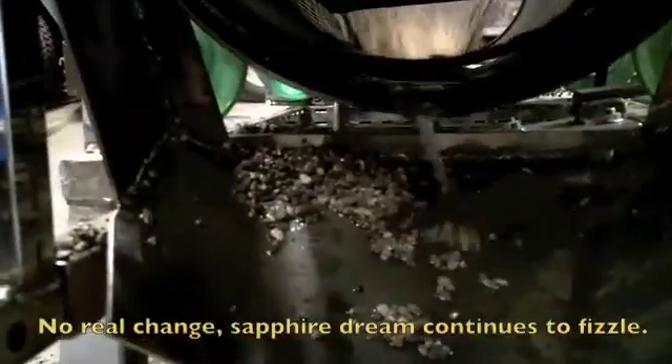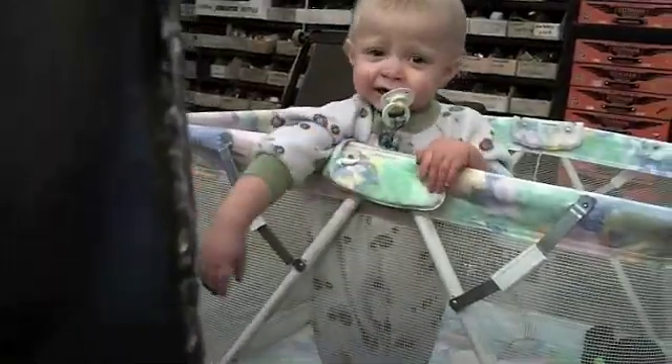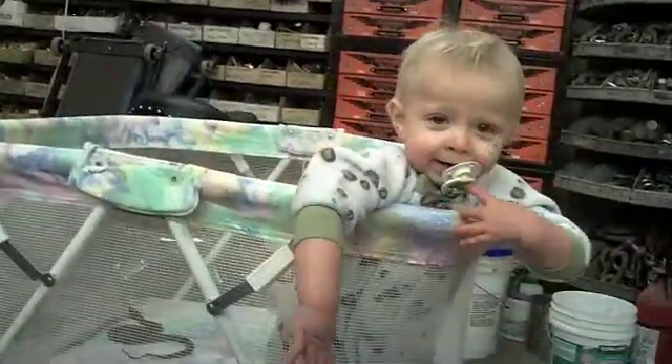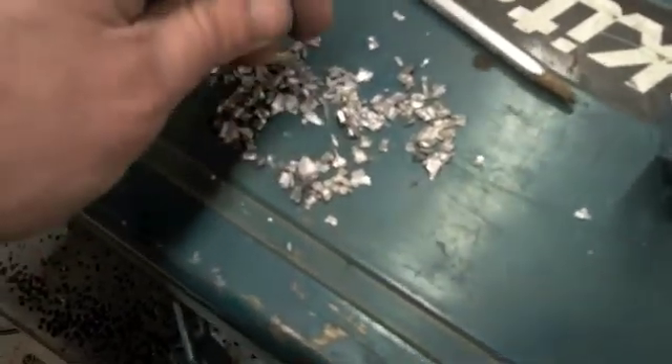What do you think of this? I still bet it's because we've got too much gravel at the same time. So this is our simulated gold — it's diced up lead. We got representative sizes, more or less, of sapphires. Certainly have some gold nuggets; they're about the same angular shape as the sapphires would be. We'll try mixing with regular soil, adding these with our rocks, because the stuff we're running right now has all been pre-concentrated — it's just our leftover buckets. We're wondering if, because all the rocks are about the same size, the machine can't handle it. So we're going to try a mix of soils.